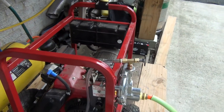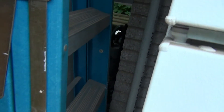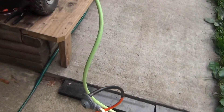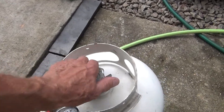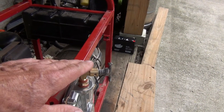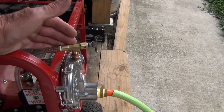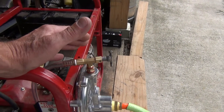For those who want to see it running on natural gas: this green hose goes into my house — there's a gas meter right there. This hose is disconnected from the propane tank. It's pretty much the same scenario, except you need a little more natural gas because natural gas doesn't burn as rich as propane. Propane burns almost as rich as gasoline, but natural gas is about halfway of propane.